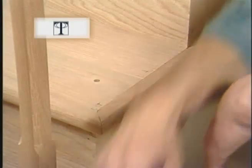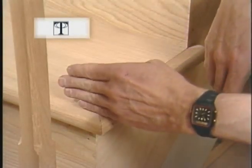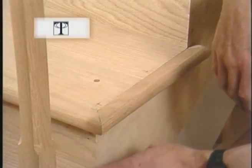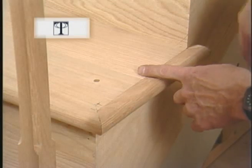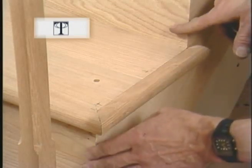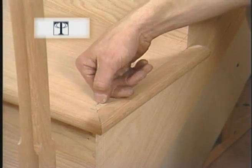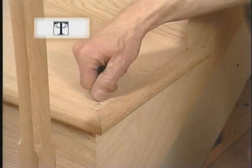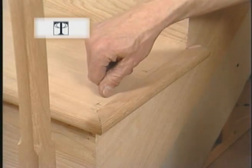The layout of the balusters is really quite simple. The front face of the first baluster for each tread is even with the riser. So the front face for the second baluster is centered between these two risers. I just measure back from that front face mark, half the distance of my baluster, and in three-eighths, which is centered over the skirt board and is the center line of my balustrade.